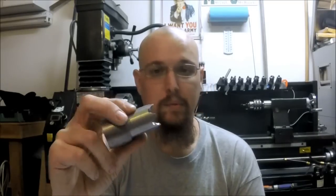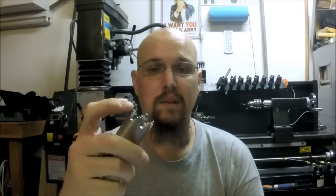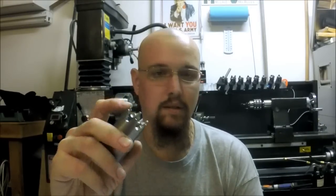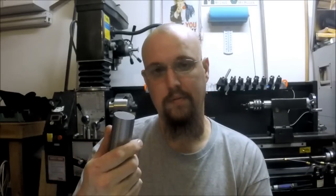We were talking about the different types of materials to use for making muzzle brakes. And I've got some 4130, and I was thinking about getting some 8620 to make muzzle brakes out of. Because I've had a few people ask me to make this kind of crown-shaped tip, which is referred to as a breacher point, for the shotgun muzzle brakes. And with 1018, I'm almost certain that these tips will not stand up to that kind of abuse. If the person ever actually uses it and impacts anything with it, I'm afraid these are just going to bend or wear. So he brought this over, which will be perfect for me to make one out of and test it out and see the difference on the strength of the two.